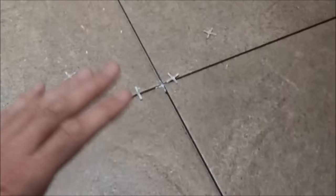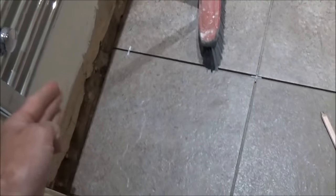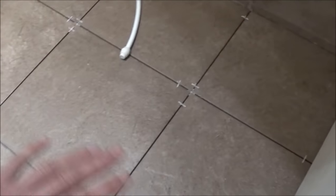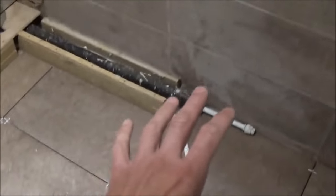When I started the tiling, I started from the door out because I wanted to get the look of these whole tiles — this is what I was telling you about the look and appearance of a room. I've managed to get about five whole tiles in. Then this one looks like a whole one but it's got a tiny bit cut off, and the same over there. The reason I've got thin cuts at the back is to give the effect of the whole tiles, and also I'm having my toilet over there and there's a sink there, so you won't really see those cuts anyway.